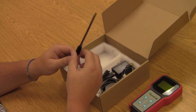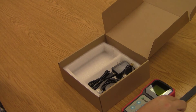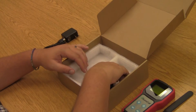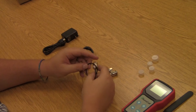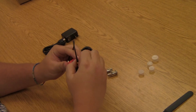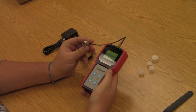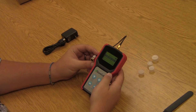We're also going to get an antenna that plugs directly into the top of the signal meter. We'll also get the AC adapter, and you could also plug directly into a USB port in order to charge the meter. There is also a series of adapters. The first one plugs into the top of your signal meter and will allow you to plug directly into the end of your cable runs before you actually install your indoor dome or panel antenna, so you can get an idea about what kind of signal you have coming into the end of that cable run.